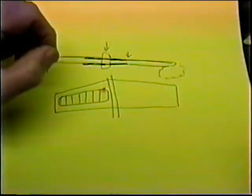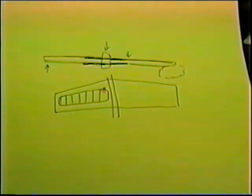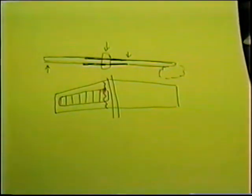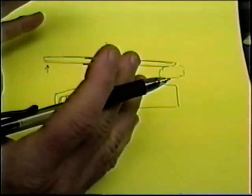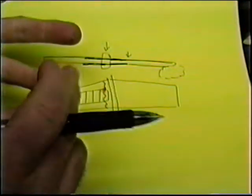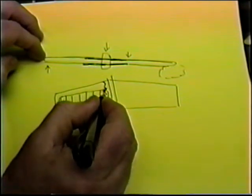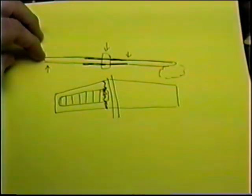In the wings similar to the one that Les is building that I've seen break, what happens? They just flat out shear right there. And I've seen several of them. It has nothing to do with whether it's a geo wing, a built-up wing, or an I-beam wing. It's the stress riser. It's the area where all the bending is concentrated.